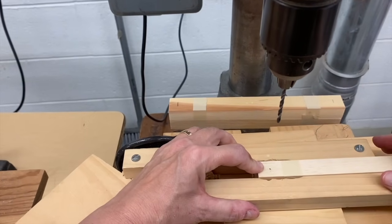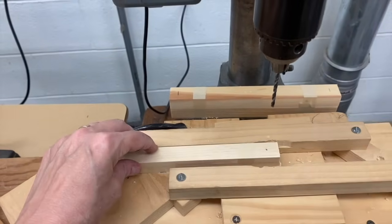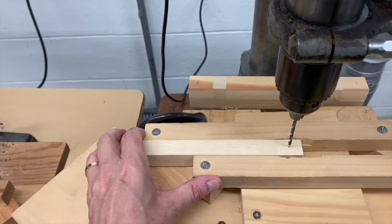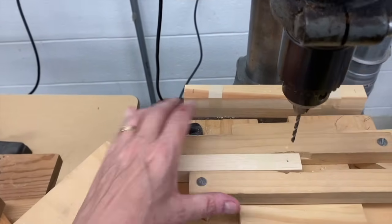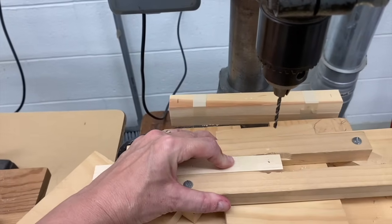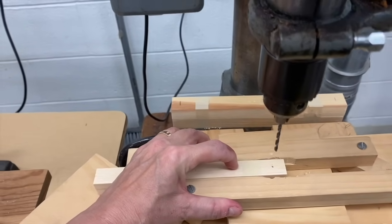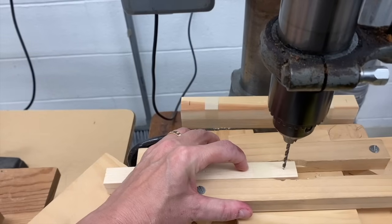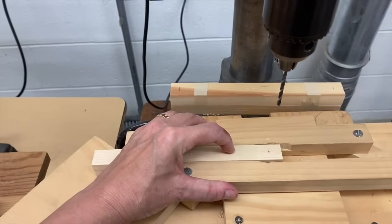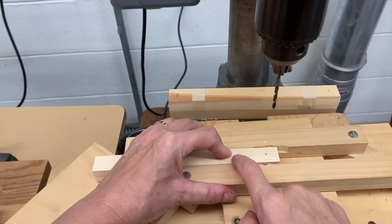What could I do to hold it down while not keeping my fingers close to the drill bit? We can just swap it around this way. I'm going to squeeze this together, line up my hole on the drill bit, squeeze the wood together and hold it down with my finger. Now I'm far enough away from the drill bit so I'm not going to potentially get caught by it, but I'm still able to hold the wood down.